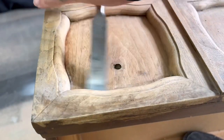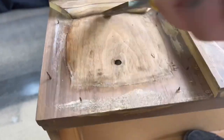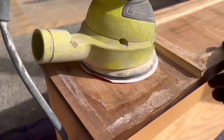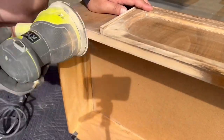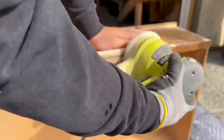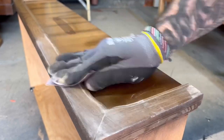For the two top drawers they had these trim pieces around the outer edges and one of them was missing a piece, so I decided to remove them completely to give it a nicer, more modern look — and I couldn't replicate that piece anyway so it just made sense. In the next few clips you'll see me stripping these top drawers down to bare wood, but I noticed after removing the trim pieces that the veneer underneath wasn't giving me a consistent color, so I decided to just end up painting them in the end.